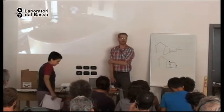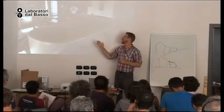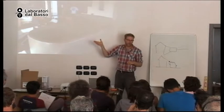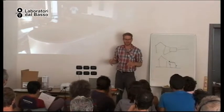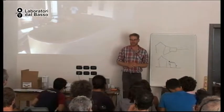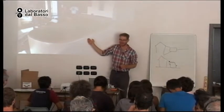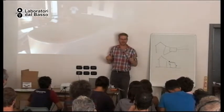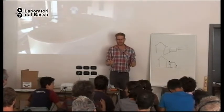They did not have a problem with humidity or condensation, but they did have a problem in winter when they have cold rain. They have all this cold water coming into the house, and they could never get warm because this was a big mass of cold. So many people have made this mistake, including some famous houses called earthships in New Mexico.